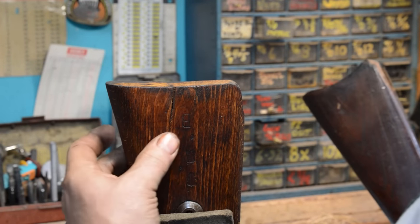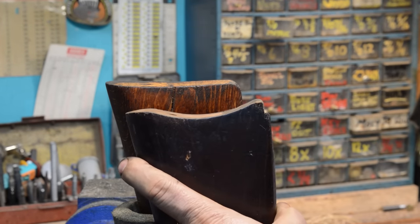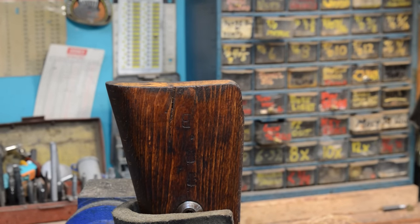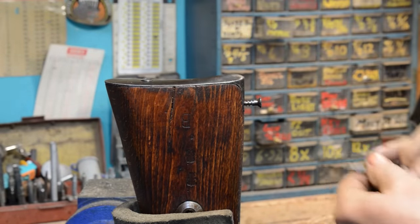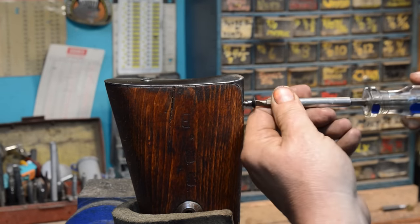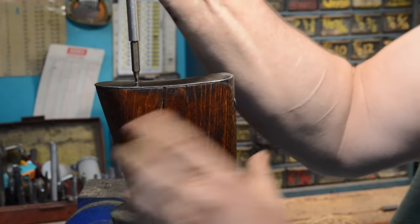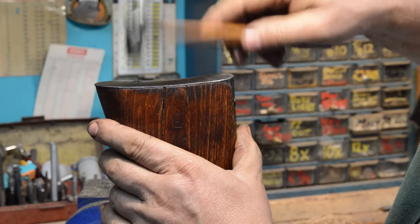The reason why I've got both stocks here is that the ends of these stocks are really fragile. So when you're going to put these guns together, the very first thing you want to do is put any nose or rear metal back on first. Don't torque that screw quite yet. As I mentioned in the trapdoor episode, the distance from here to here is a lot less than the distance from here to here. So the first one you torque down is always the short one — that lifts this gap. Then you can come back in and tighten down and pull that gap out with a lot more leverage, and then you don't have to hit the screws quite as hard. Then I just give the screws a little tap — that does two things: if you raise a burr on a screw slot it beats it down, and it also gives you just a little bit more torque.